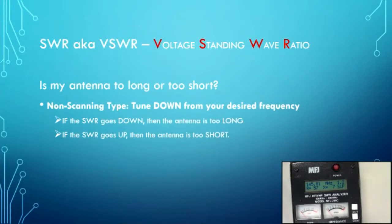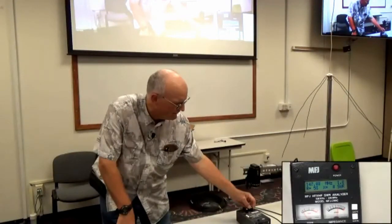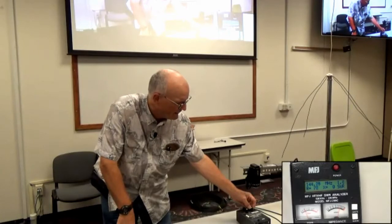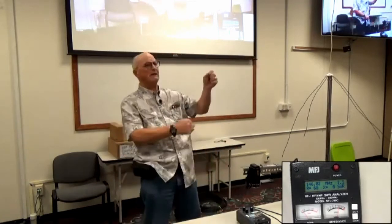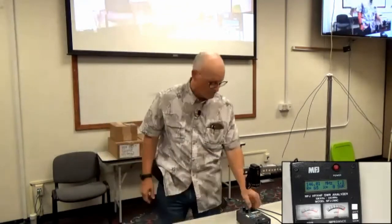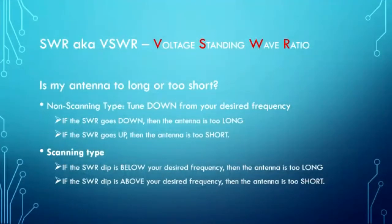Well, you grab it up. That's part of the problem. It's going to sleep. Wake up. There we go. You grab your frequency and you start going down in frequency and watch the SWR. You notice that the SWR is going up. As I go up in frequency, the SWR is going down. So in this particular case, because the SWR is going up when I go down and down when I go up, this is too short if I wanted it at the lower end of the band. I'd have to get my cable stretcher out if I wanted to tune better. Otherwise, you'd have to snip it to get it to tune if it's too long, obviously.